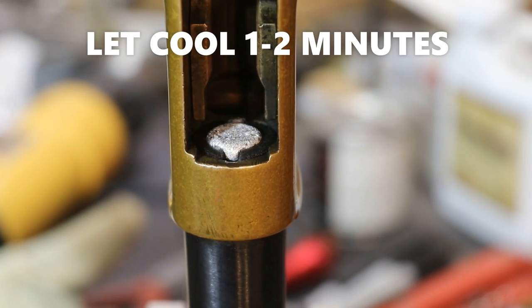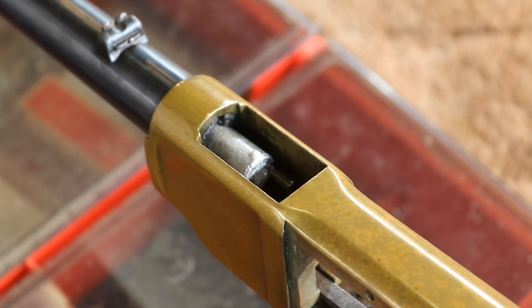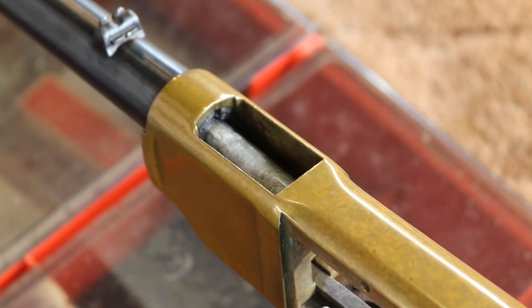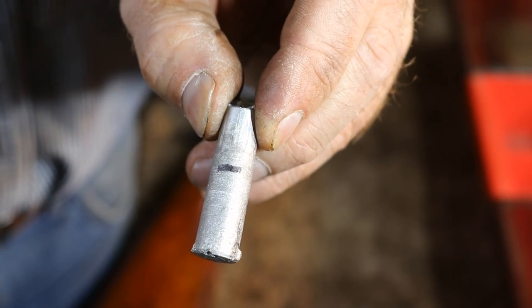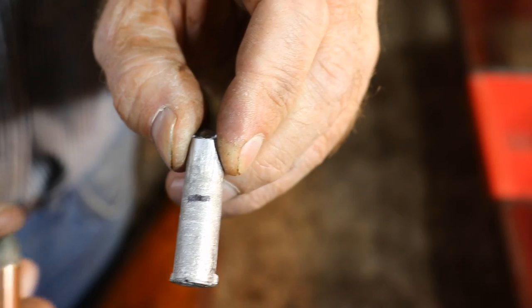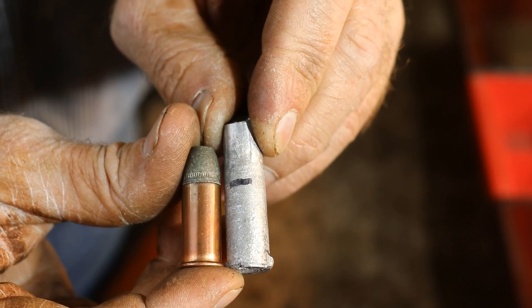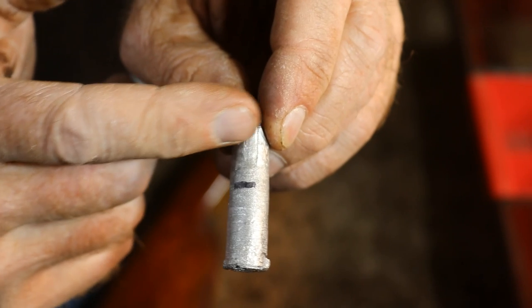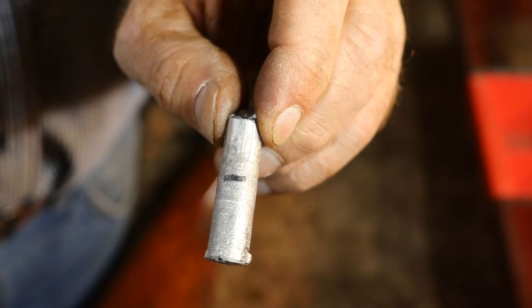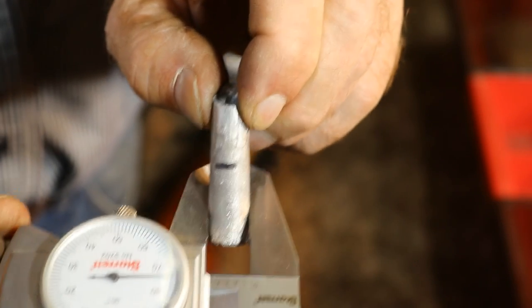Here's what the top of the chamber cast looks like while it's still in the chamber. We overfilled it just a little bit because it does tend to shrink a smidge as it cools off. Let's get it out of there and see how we did. We got a real nice chamber cast here. I put a little mark right at the front of where the cartridge case would be. Because this is a 44 Henry, a straight-walled cartridge with a heeled-base bullet, we wouldn't expect to see any tapering through the chamber area out into the rifling. We can see some start of rifling out here, although it's fairly weak. With the naked eye I can see pretty clearly that there is some tapering.